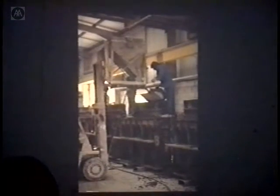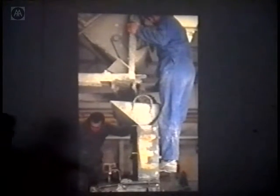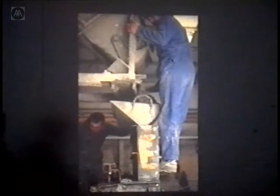And meantime, the water is leaking out at the bottom, so we know what that's going to do. That's going to produce a permanent blemish in the surface of the edge of the unit. And then we put concrete in the top with a little hopper to enable them to feed the concrete into that narrow slot. And they vibrate it, of course, to get the concrete in. Remember, they build it to this level to start with, and now fill it to that level. And of course, would you believe, on every one, there's a mark where the vibrator has gone in, trying to marry those two bits of concrete together.